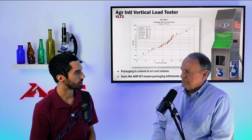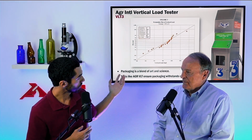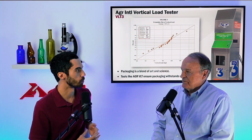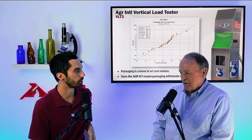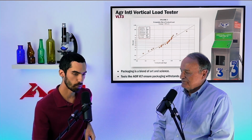But as soon as we start putting damage on them, that fracture equation comes in, and based on some projections, you could be breaking maybe 1 in 1,000 or so bottles at the cap. And that kind of breakage level is not acceptable. Right. So that's what we're trying to get across.